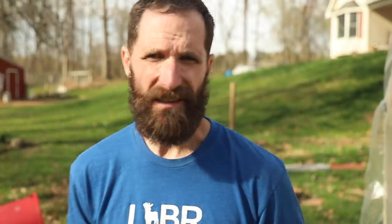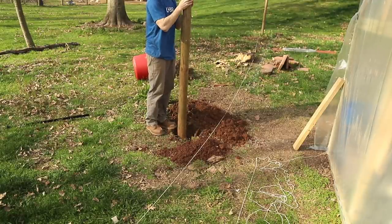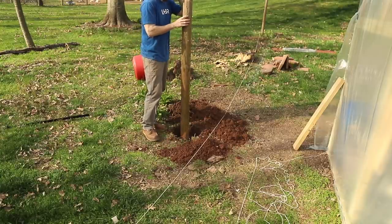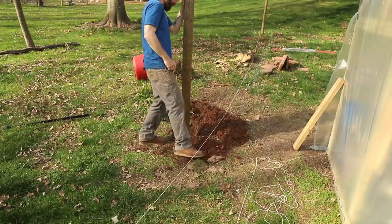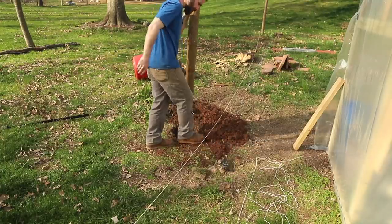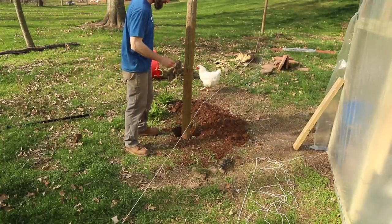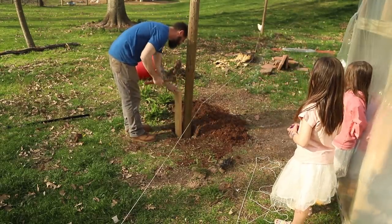I'm not sure if I'm going to brace the corners yet — I haven't really decided. I probably will, but at least now they're in there pretty good. I'm going to fill this hole back up and decide what to do with the rest of the fence. What I do first is tap down the dirt in there, make sure my hole is packed and flat. You can pour stones in there, you can put a concrete pad in there if you want — that keeps your post lasting a little longer. Once you get them in, keep your post still, put about six inches of dirt in, then start packing it down. I'm going to put a level on the top of the post. And just like that, we've got all four posts in.